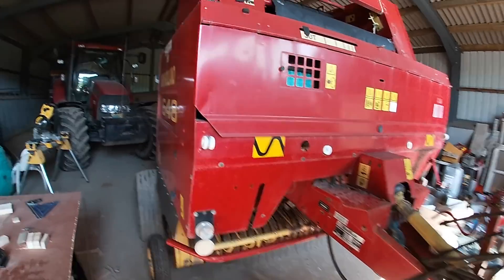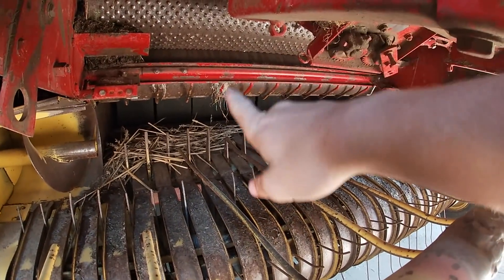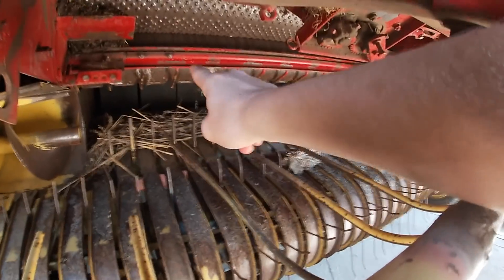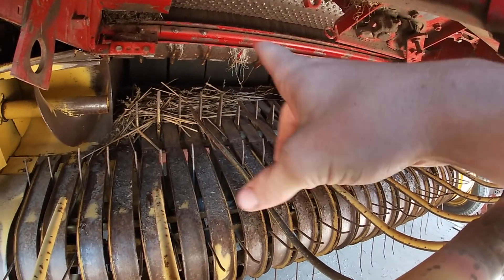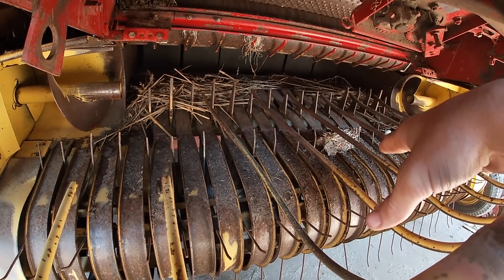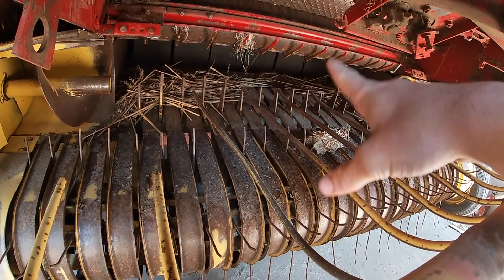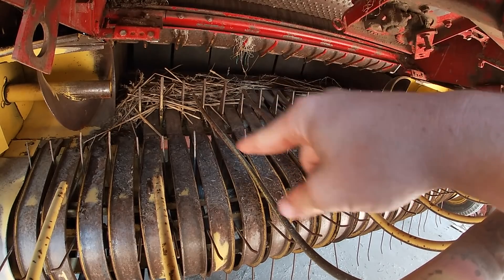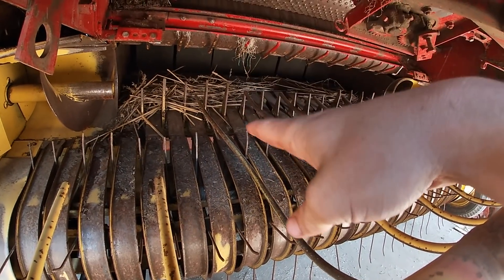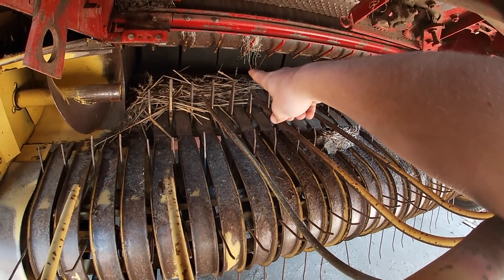Today we'll get the side panels out — a little bit of work to do in the bed here. You can see there are the rollers. There should be another set of these further up in there, but they broke out. I don't really see the point in putting them back in because they don't seem to make any difference on the feed of this baler, but we want to put them back in because they're supposed to be there. It's a wide and deep pickup bed on this baler, which a lot of balers are now. The old 545 baler we had was a straight-up pickup bed — it'd come off the bed straight into the chamber.